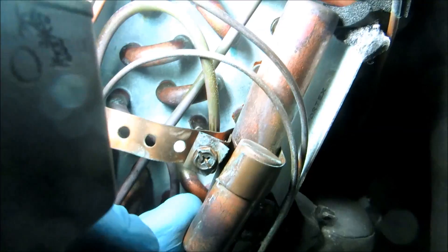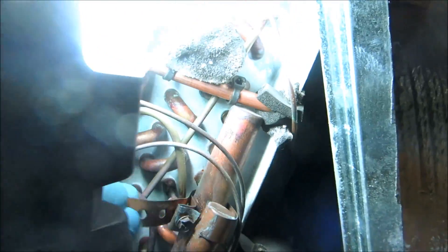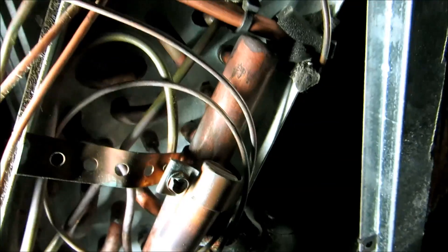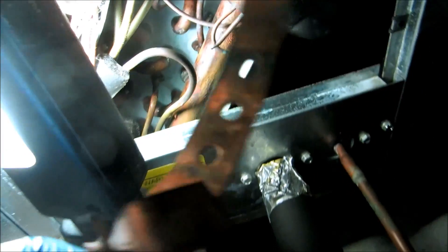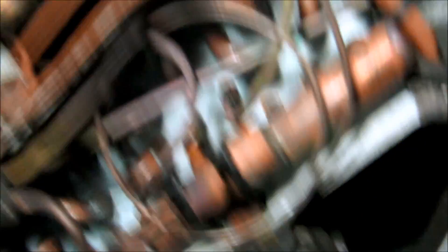Alright, no superheat. See, my sensor broke off right there — the thing's just floating in the air. I'm going to look around. I don't have any of these in the truck. I'll just use some pull ties for now, and I'll have to get some of that copper strap and some insulation for it also. I've got to strap it onto that hood. That's it — it's just temporary before we get back here with another strap.